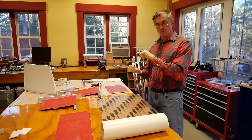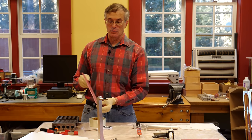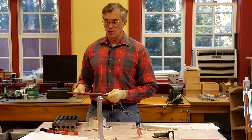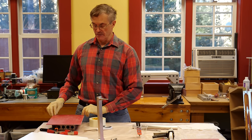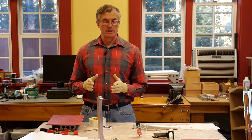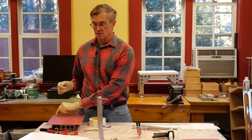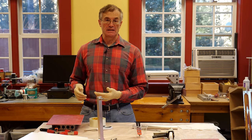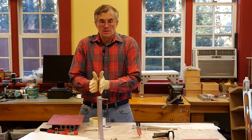The way I actually fabricated these rudders is quite simple, and I'm going to demonstrate that. I took some 3mm thick fiberglass panels and cut them identical in terms of size. Then I'm going to fix one end — that's going to be the trailing edge of the rudder. In stitch and glue boat manufacture, this is an ancient technique involving drilling tiny holes along one surface and suturing it together with copper wire, which approximates the surfaces but gives them the ability to hinge.